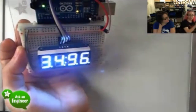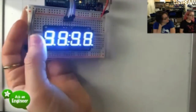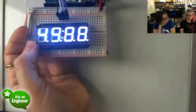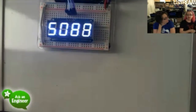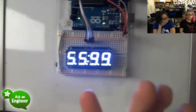We also have it with the I2C backpack, because it's really tough to control this many LEDs without one. Our I2C backpack uses I2C — you can have up to eight of them on a bus. We have Arduino code and Raspberry Pi code to control these, so they're super easy. Without the backpack you'd need around 14 digital pins, but with I2C you only need two.